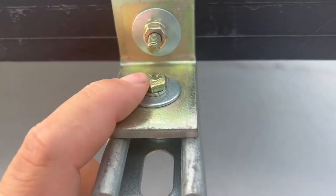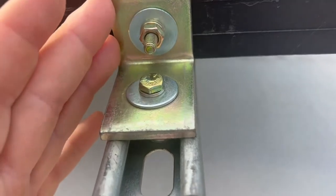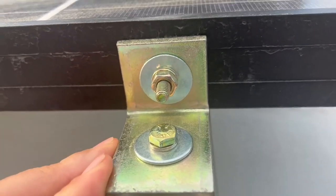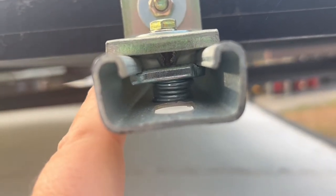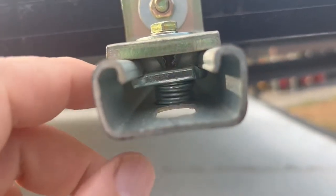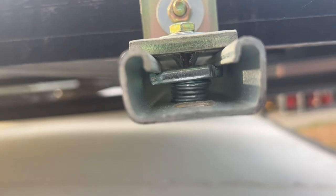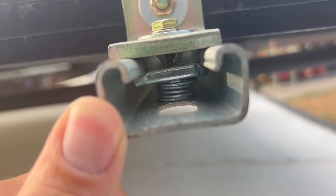I used grade 8 bolts and nuts, some washers, and there's a bracket — these are actually from the electrical section too, they're for struts. There's a nut that goes in the strut channel — I can't remember what it's called right now — but you put it down there and it hooks to the lips. You can screw into it and it won't move, but you can slide it up and down the channel. They have some better nuts for this but they weren't in stock at Home Depot or Lowe's, so I just got what I could get.